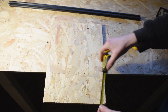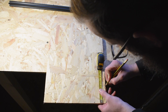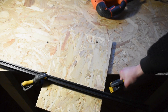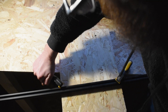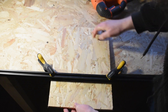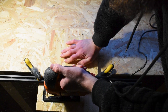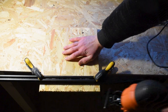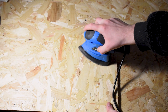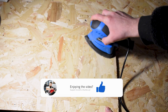When it comes to cutting your panels, if you've got a decent sized table saw this should be relatively easy. However not everybody does, and I managed to do this using a jigsaw. One tip is to use other pieces of wood as a guide — in my case I was able to clamp down some old 2020 extrusion I had lying around the workshop. After carefully measuring each side you can use that guide and easily cut through your material. When you're done you can also sand the material down for a cleaner finish on the enclosure.